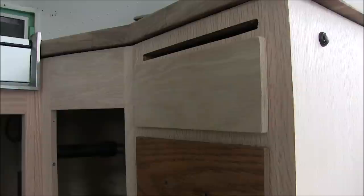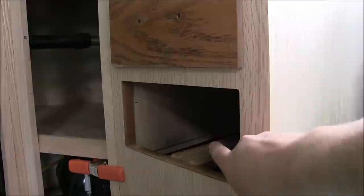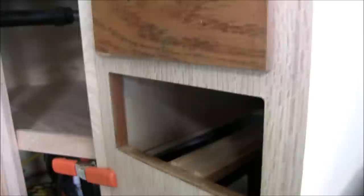Except now I had to cut out holes. What I did was drill a hole here and plunge the router in, then follow along the hole on the outside and cut the hole. It's very, very smooth and there's a very small possibility of it coming chipped or undone. Now I can sand this really smooth and pick my stain out.